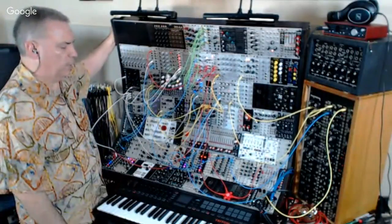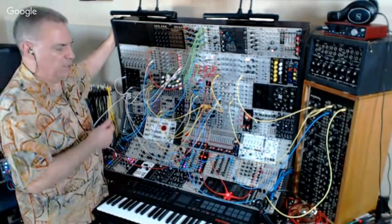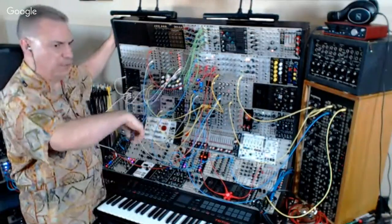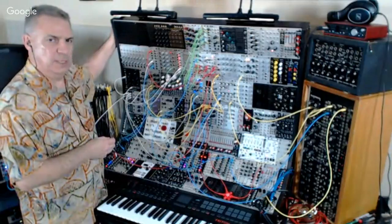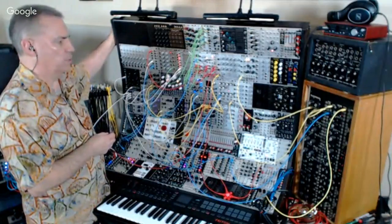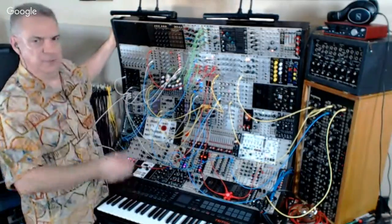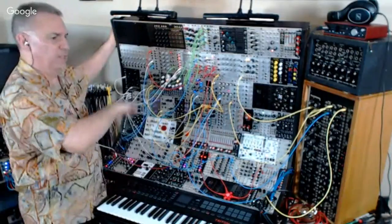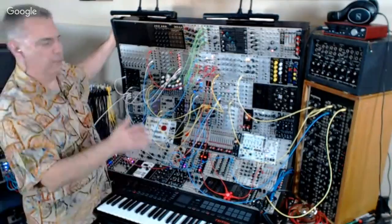When we were developing the wave shapes for the Prophet VS, we had a piece of software that Josh Sheffield wrote called Hacker, where we could do the equivalent of that, drawing the waveform, the same as using the stages. I do play around sometimes with using sequencers as complex modulation sources, as part of my attempt to get beyond the tyranny of the triangle wave. I want something more complex in the evolution than just repetitive up, down. And I have a whole rant, by the way, about sine waves versus triangle waves and LFOs.